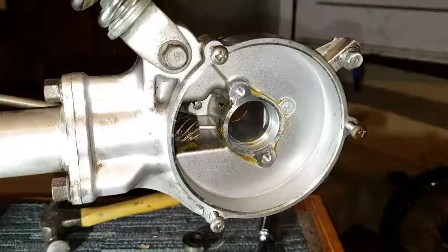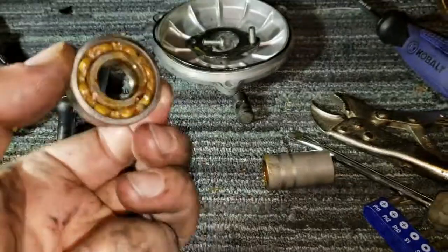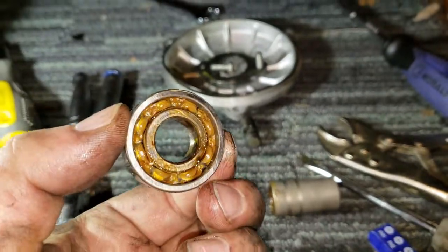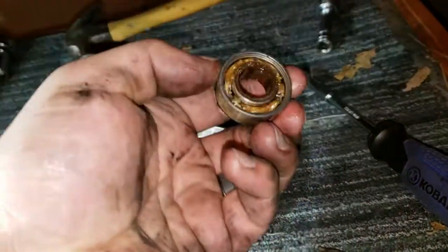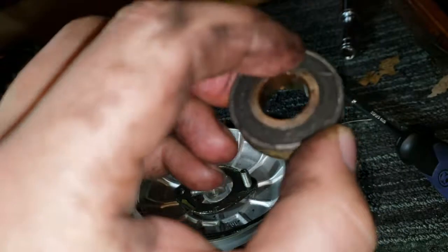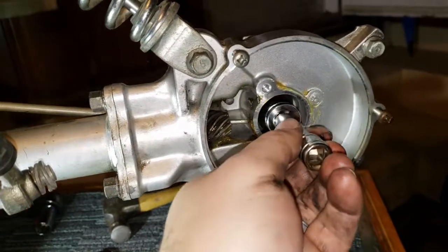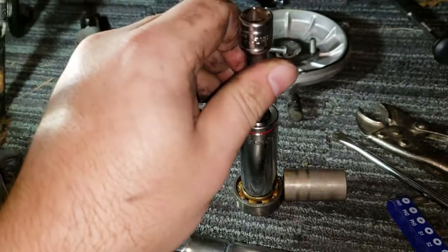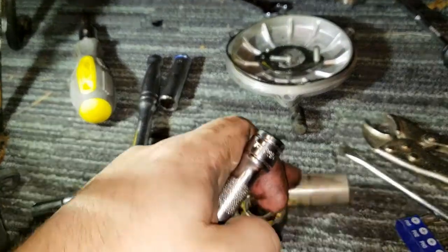Once I took that bracket off I was very easily able to pull this bearing out on this side — it has both sides open — and this spacer. Then there was a bearing on the other side, open on the inside and sealed on the outside. To get that one out from the other side, I put a socket in here and pushed it right through to where the bearing was on the other side and popped it right out. I did use a socket size that would fit on the metal — when putting it in, I want one that fits around the outer edge to tap it in evenly.